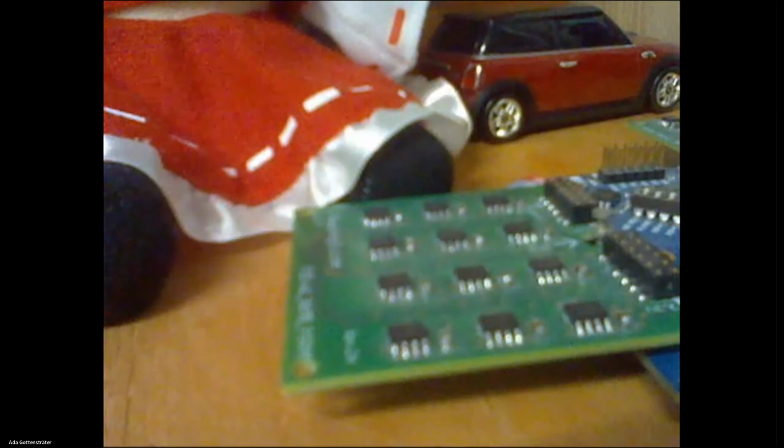The 6100 has a completely different addressing scheme in that chip than the 5100 version. It's not just that it has 8 sockets instead of 4, which is not that much of a problem. The problem is it also supports IPv6, so it has tons of registers for IP version 6 sprinkled in between the other register space. And funky registers. Have I talked about the greatness that is the register set for the Yamaha FM chips? Suddenly it's separated into different areas, and I have to figure it out. It was so easy before.